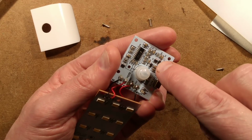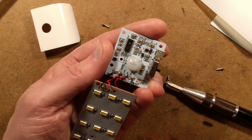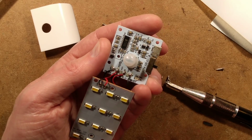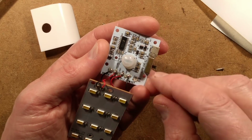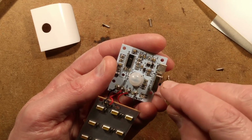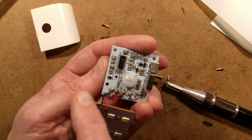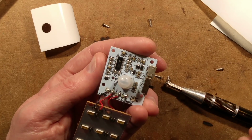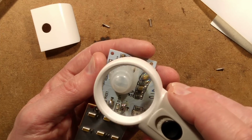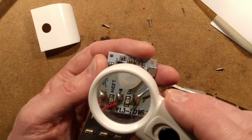I'm guessing because that chip is directly next to the charge port, that will be the charge controller. It will probably be one of those little generic charge chips like the TP4056, but in the tiny package, the little 6-pin package. The transistor, I'm guessing, is for switching the LEDs. What's this one for? That'll be a voltage regulator. 662K.